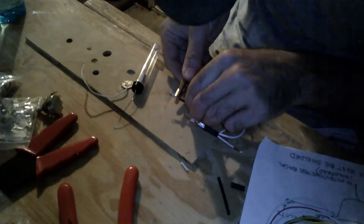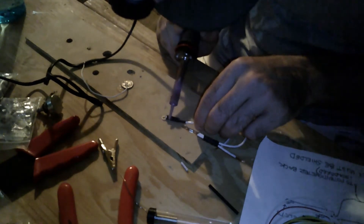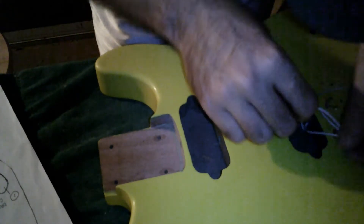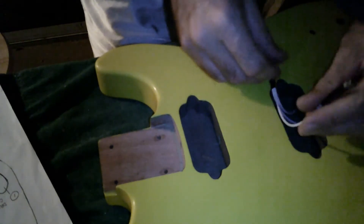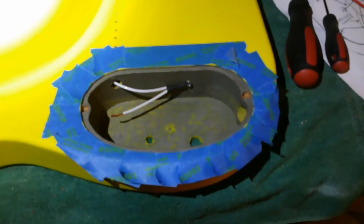Now we're working on the wiring harness, and that's what we're using for our ground wires — going from the bridge into the pickup cavities and then into the control cavity as well. Using the soldering iron to shrink the heat shrink wrap. This is some pretty thick wire, actually left over from a ceiling fan I had installed. The pickup ring screws were way too long with what they gave me, so I used some extra pickup ring screws I had for EMGs. They're much shorter and worked perfectly.